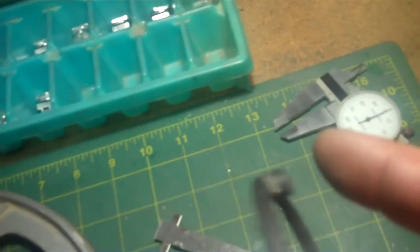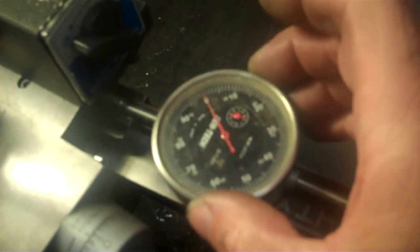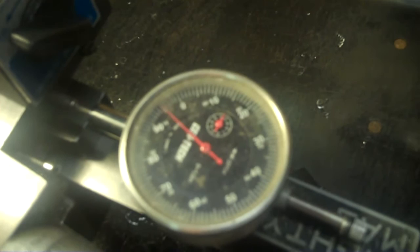Okay, the height of these feet are anywhere from 200 to 210 thousandths of an inch. So I'll go about 210. What I did was I touched off here again. I'll take that forward now into the bore and adjust this in now, 200, 210 thou. I'll make it about 215 because it's going anywhere from 210 to 220 on those feet. They're plastic feet, so they're within range. So I'll go within that range there.